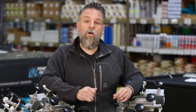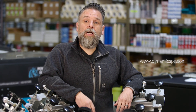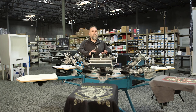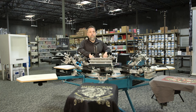This is a right-to-know issue with your employees, which is important, because you don't want OSHA to come in. Certain areas have air quality management districts and things like that that are gonna require these forms. A lot of these forms are available on our website, DynamicSPS.com, or there's also a great resource online called MSDSOnline.com. What you need to know is: make yourself aware of them, look at the products you use, update the forms from the MSDS version to the SDS version, and keep that book out there so everybody has access to it. Call your distributor, call the manufacturer — there's lots of ways to get this information, and it is important.